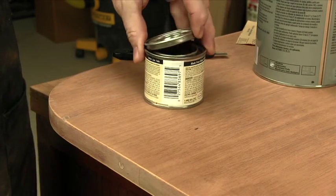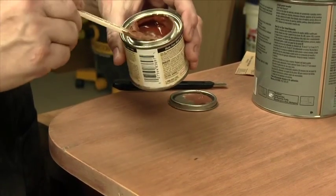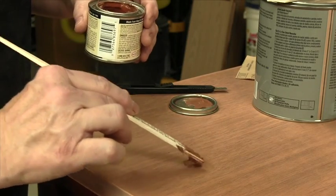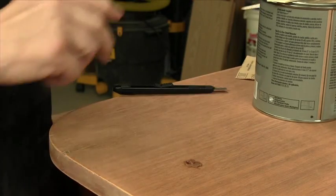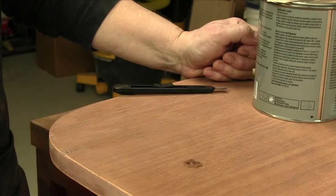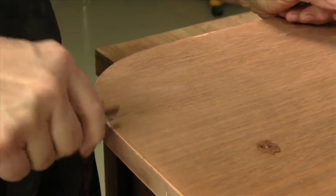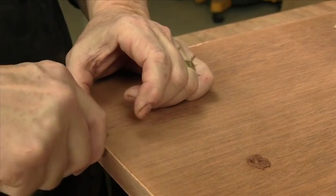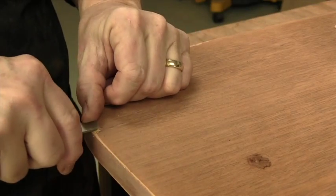So we're going to go through the two fillers that you'll need to get this table smooth and ready to stain. This is a hardware store variety filler — you need to stir it up. Make sure the colorant in there is good and mixed in. This is perfectly fine for a little hole in the interior of the surface. However, for an edge that's going to get a lot of wear and tear, this filler would never be strong enough. Since this area is full of old dirt and paint, we're going to carve it out a little bit — pull some of the old wood off and create a new fresh hole so that the filler will actually stick.